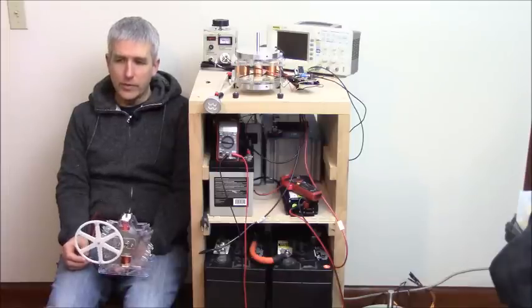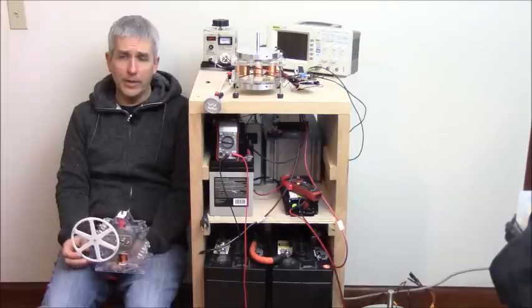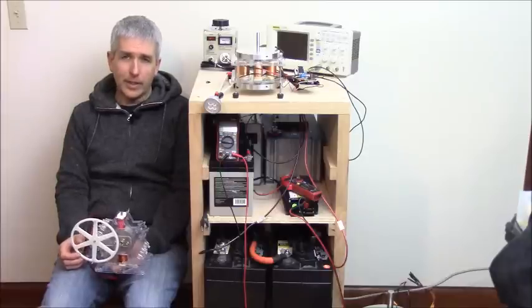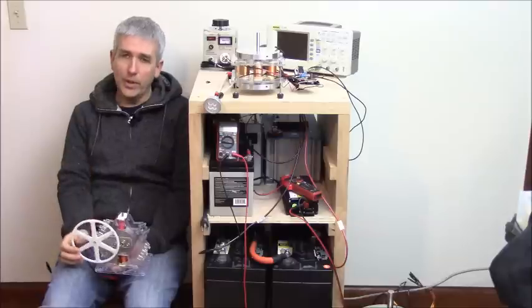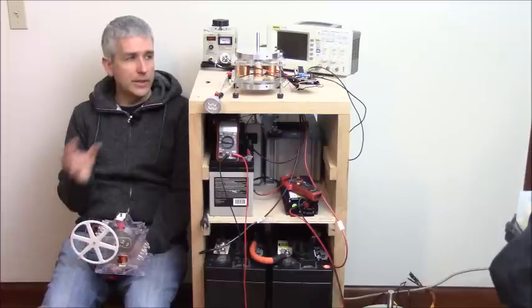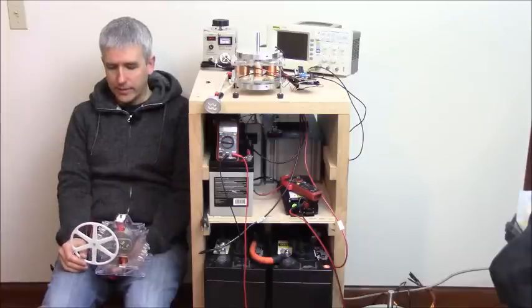So I decided to use the battery bank that I had in my shop for 3 years, which was 2-volt batteries at 48 volts. So we had 2 different kinds of cell phone tower batteries that had 2,000 amp hour capacities in them. And so this was a ridiculous example, not of how you use the batteries most practically, but it's showing you the greatest gain that I've ever experienced with this type of system, with the basic circuit. There's nothing more advanced on this. All of this is at the basic level. There's no third stage process, second stage, or any other kinds of tricks.